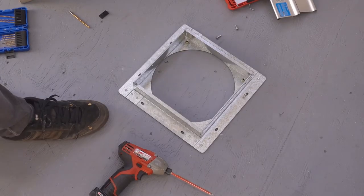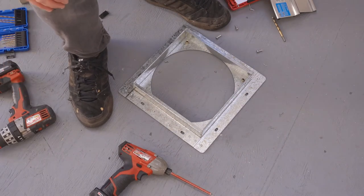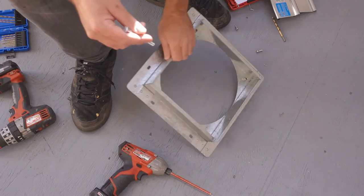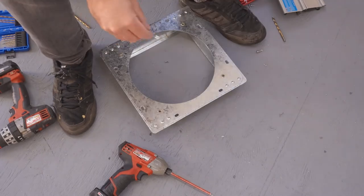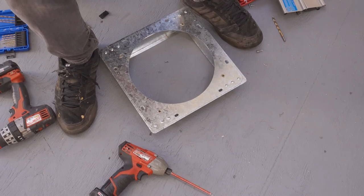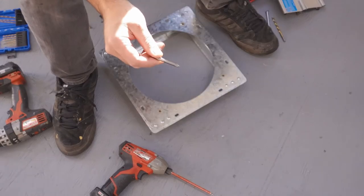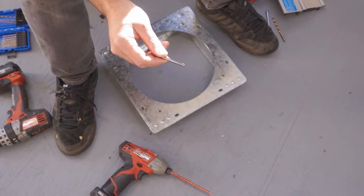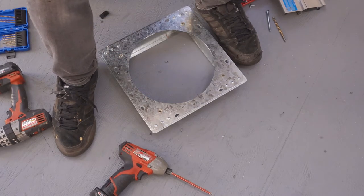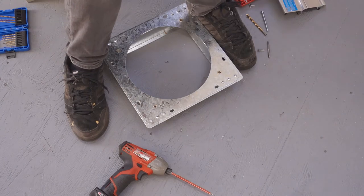All right, so part of the grand plan here is these nuisance holes. I need something along the lines of a 3-inch bolt in order for my pancake to work, or my sandwich, but the stock bolts are M6. No way I'm finding an M6 3-inch bolt on a Saturday. I do, however, have a 1/4-28 tap. And that's the second time I had to run all the way out to Home Depot, to get the 1/4-28 bolts after I realized I could do that. So basically, what I'm gonna be doing is re-tapping these holes.